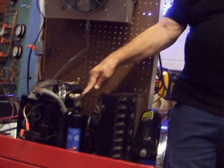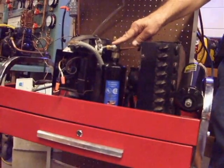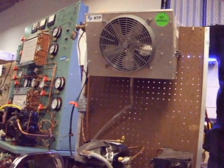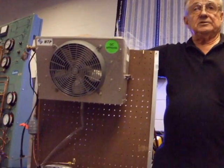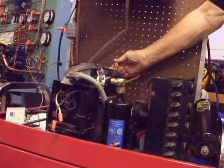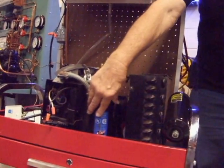This is the direction of flow. This is the king valve. If I close this, I can pump the system down and work on half the high side and all of the low side. With this open, the system is running liquid through here up into the metering device, which could be a thermal expansion valve or a capillary tube. In any event, it drops the pressure, forces it to go to low pressure, low temperature liquid. It absorbs the heat in the evaporator. We put superheat in it, bring it down the suction line into the compressor. We pump it into high pressure, high temperature vapor, into the condenser, and it converts back into a liquid. We add subcooling to hold it in a liquid state. It then goes into the receiver tank where we can store it.